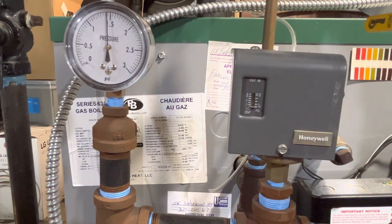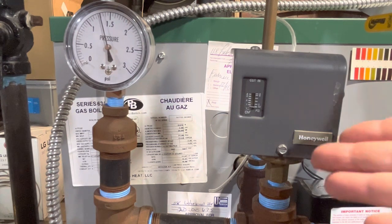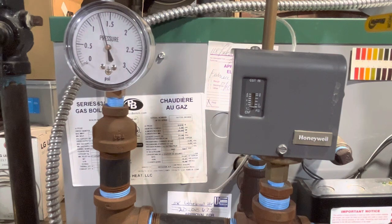You're just burning fuel to add pressure to a system. For what purpose? Your radiators are condensing as fast as they can. You've got too much steam production. And so to just build pressure in your system with the fuel burning that whole time, it's not making your house warmer any faster. Okay, I gotta say this because someone will call me on it.